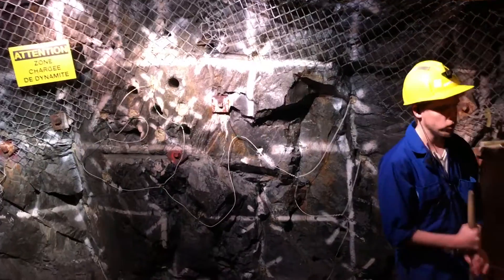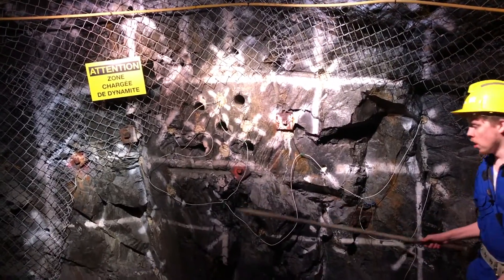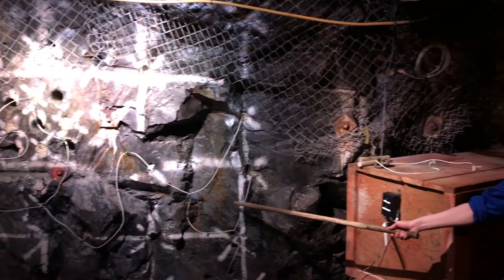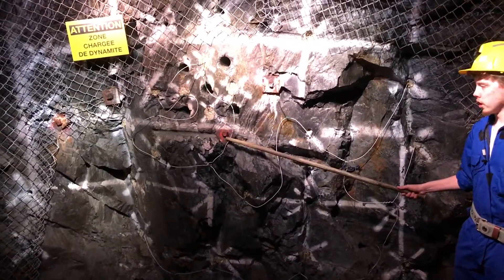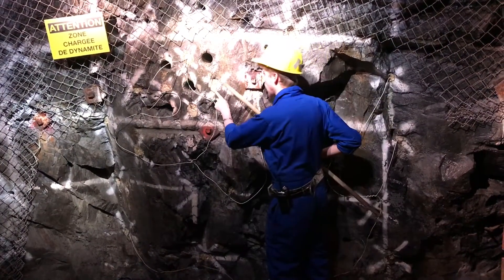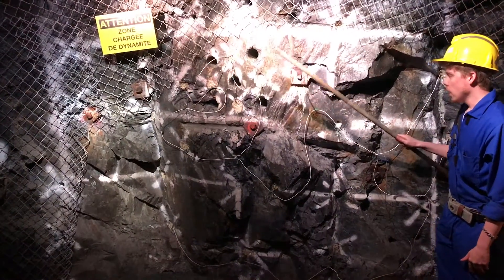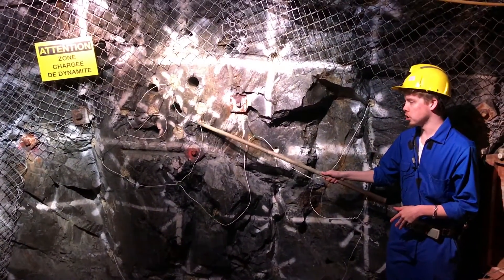Before we do the blast, I'm going to briefly explain all the components on the wall here. You'll notice this big long wire — it extends all the way across the wall to that side, then comes all the way back over to here, and then goes back over to the other side. We call this the ignition cord — this is what we light when we're ready to do the blast. What the ignition cord does is connect these things here that we call charges, and the charges are just the holes that are filled up with dynamite. You put your dynamite in the holes, cover the hole up with clay, then take the fuse from one of the sticks of dynamite and attach it to the ignition cord.